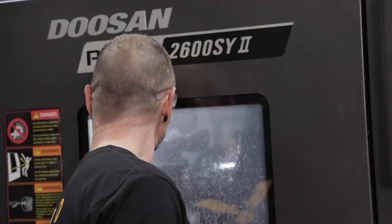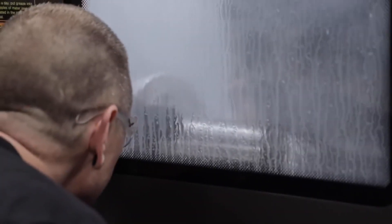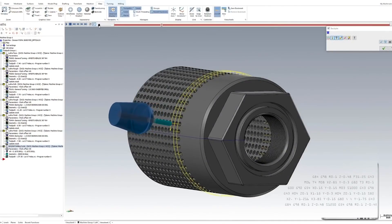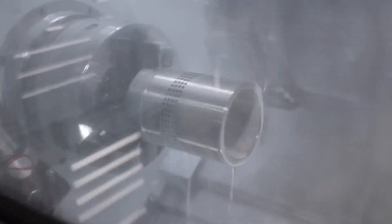To prove out the process, I brought a couple samples of the foam to the water jet guys and asked them to cut me a couple rectangles out of it. It worked great and it was super fast, so we agreed this was the process to use on the routing. Little did I know that the water jet guys were unhappy because the foam cut by the water jet floats on top of the water, and they were going to have to use a swimming pool leaf skimmer to get what was essentially clumps of sawdust off the top of the water table after each sheet.